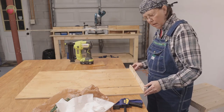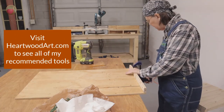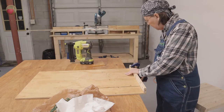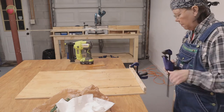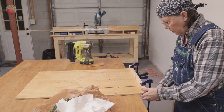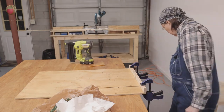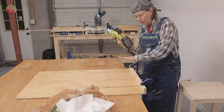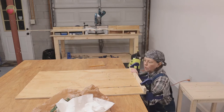This is where these handy clamps come into play again. I'm not going to put it right at the end because I need to brad nail toward the end, so I'm going to come inside just a little bit. Now you need to be real careful when you do this part, because these brad nailers are great tools but they do shoot things up really hard. So don't ever have your hand over where you're shooting. I'm going to get down below this and shoot these in.